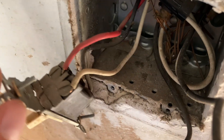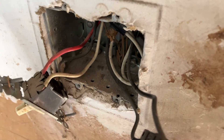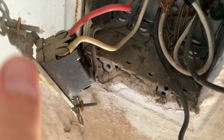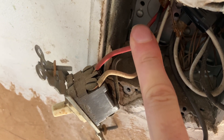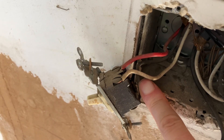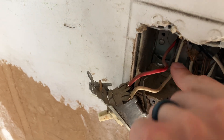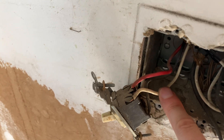Here are the two switches close up. This is the single pole going to the outside light — that one's very simple, it's just a straight swap. Over here we have something a little different. You can see that for some reason they used the white and the red as the travelers, and then they used the black as either the incoming power or the power going to the light. So we'll just have to keep an eye on our pair of travelers. Usually you use black and red as your travelers, but they did something a little different this time.